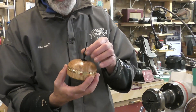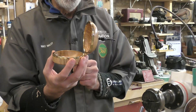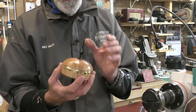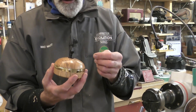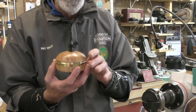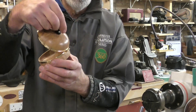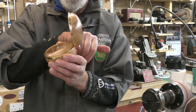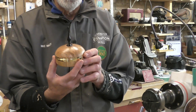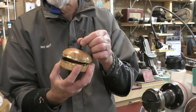Here's the finished box - it's great fun to turn and a great hinge as well. The feature I've explained is that it won't open any further than 93 degrees, so it won't come into contact with a surface and break your finial or knob off the top. The most important thing is to be careful: many small cuts as opposed to one big cut, don't take off too much wood, get a nice snug fit, and you want everything as seamlessly joined as possible. It's important that the base is flush with the hinge ring. I'll put a link in the description to Procraft's website. I hope you've enjoyed watching - don't forget to subscribe and I'll see you very soon, cheers!